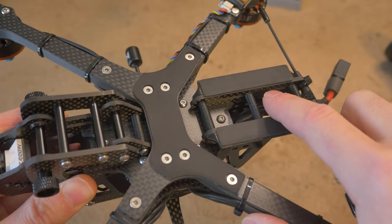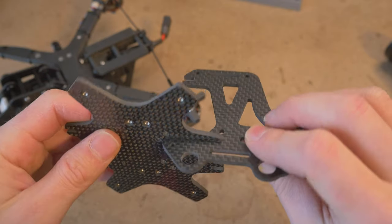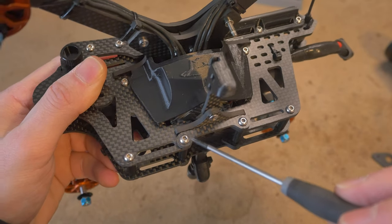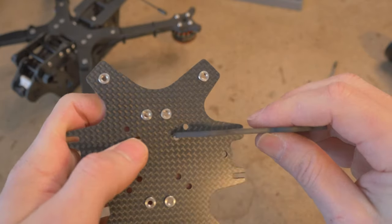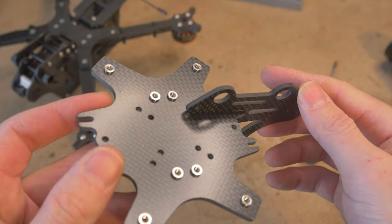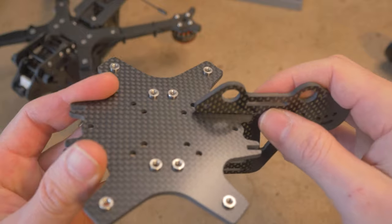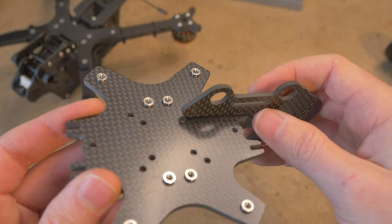To connect vertical plates to the horizontal carbon fiber plate, I used a finger interlock system where the vertical and horizontal plates interlock together. For the top portion, 3D prints run around the standoffs to lock the vertical plate to the horizontal plate with an M3 screw. Joists at the bottom keep the front and rear plates from splitting apart in a crash. One benefit I discovered is that this interlocking carbon system actually provides some vibration damping — something I learned from working on the Viper, a work-in-progress CineLifter X8 frame for heavier payloads. The interlocking joints did a really good job of dampening vibration and resonance even in thin carbon fiber pieces.